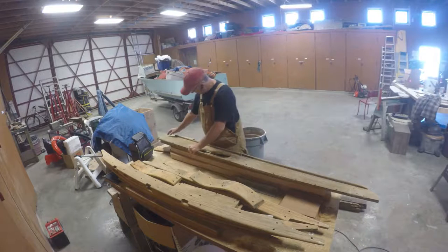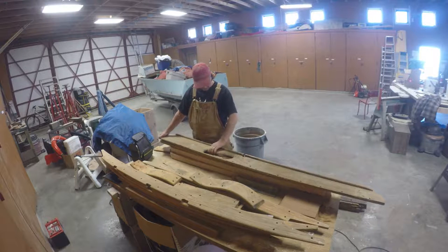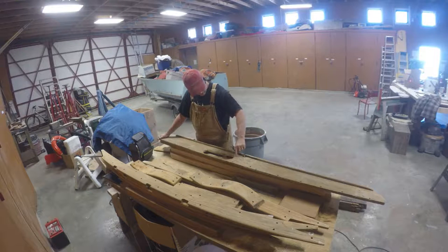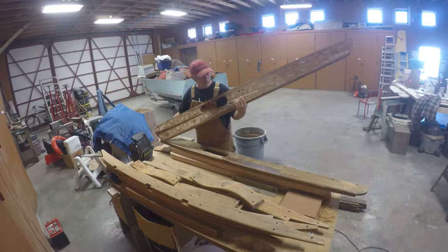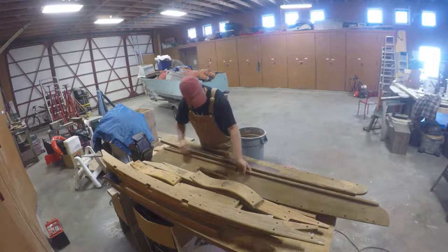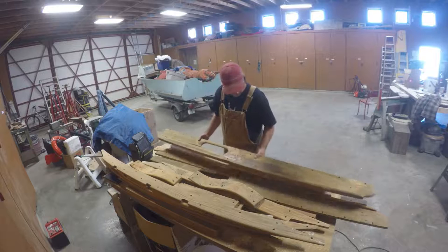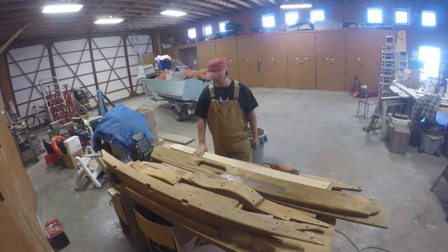This other platform I think I'm just going to repair — I'll throw some epoxy on it, clamp it, and it should be good. There's a historic split right there somebody else tried to repair; I might router that out and put some epoxy into it. You can see somebody did it from the back side and didn't do a very good job, but that should hold — better safe than sorry. So I've got these pieces to sand, three pieces to fill, and the platforms to deal with, and we're pretty much ready to clean, penetrate, epoxy, and put everything back on. Making progress.